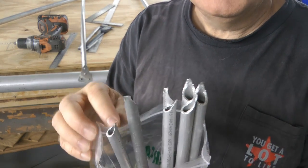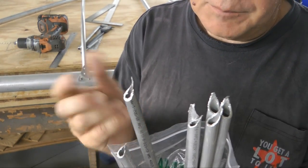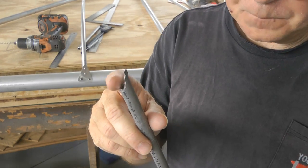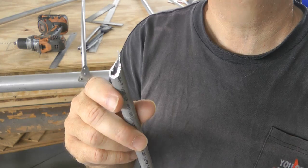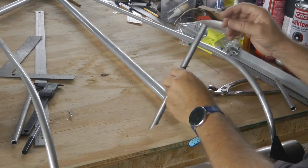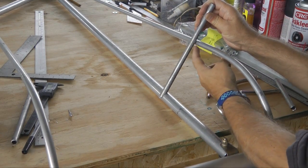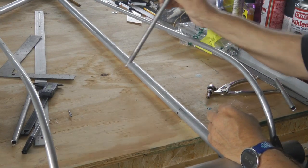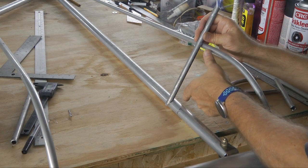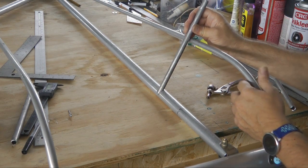Here's a bag of them — these were the cutoffs from making our wing ribs using the hole saw. So you may still have these, which will save you time using a hole saw to recreate this, because this fits nicely on the bottom cross member. The pre-existing cutout works very nicely there and can be put into any position. We just want to measure the distance to wherever the rib comes, since we'll have one here, one here, and one down there — the distance is different. What's nice is you don't have to measure exactly, because as you move it back and forth the distance changes, so you can pick the spot where it fits best after cutting.